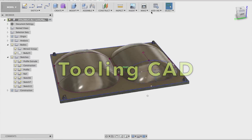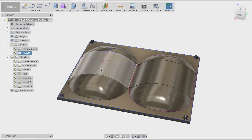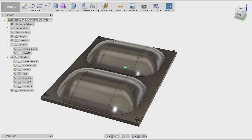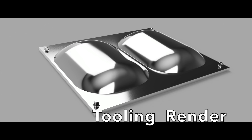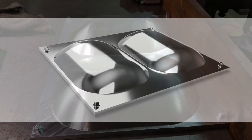I also had to make the CAD data of the actual tool that's going to be cut by the CNC machinist. The tool has a couple of little notches in the four corners — registration marks — and those are going to be important and helpful later in the manufacturing process. This is the final rendering so the tool maker and the client can see what the tool looks like.